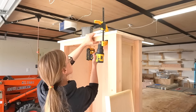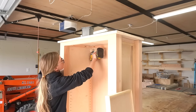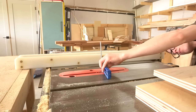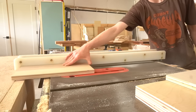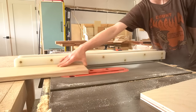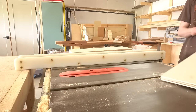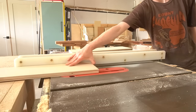Then I centered and secured the three-quarter inch plywood top panel with two-inch wood screws through the top frame. I had ordered the drawer slides and hinges online, and while I was waiting for them to be delivered I went ahead and cut down the pieces to make the drawer box and the shelves so everything would be ready to finish up as soon as they arrived. I cut dados in the drawer box sides and applied edge banding to these pieces and the front edges of the shelves.